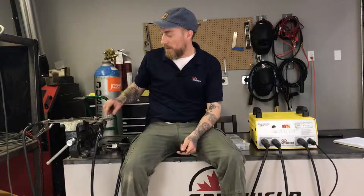This is our CAD-101 stud welding machine. This is a fairly small size unit so it's got a small footprint in your workshop, but it's pretty heavy duty. You can weld up to five-eighths of an inch thick studs with it, or all the way down to the number four size studs, so it's got a pretty broad range.